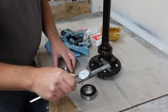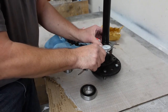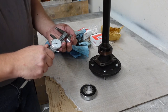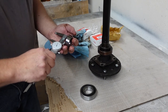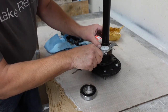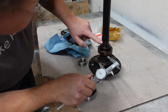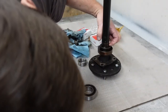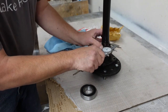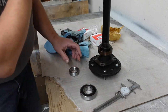1.967 also. So we should be good. And then this shaft measures 1.350. The ID measures 1.370. It's bigger down there — right at the bearing. So here it's 1.350, but down right on where the bearing is, it's 1.370. So yeah, that is a press fit on there.